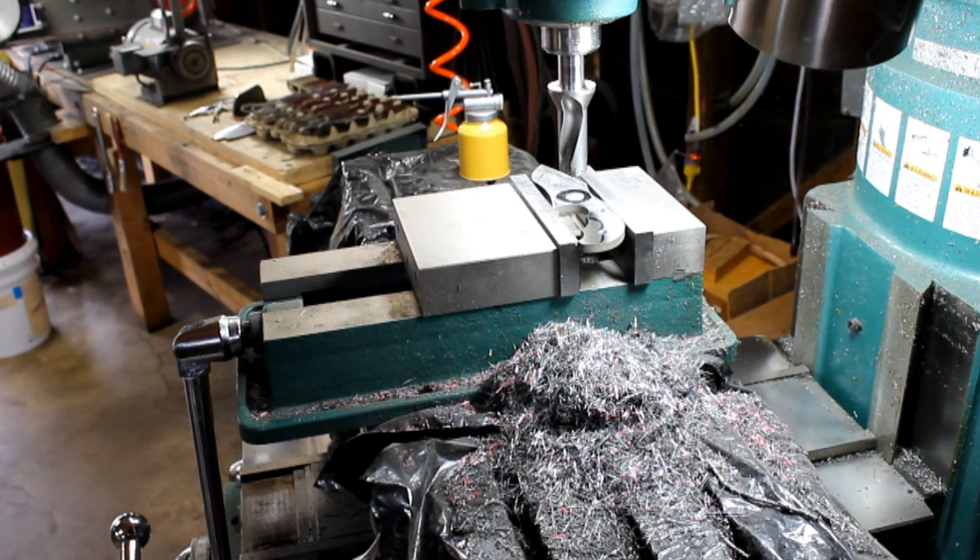Trying to put a tool like this in a drill press is going to ruin your drill press, your piece is going to come flying out, it's going to cause a lot of damage. So if you have a manual mill, then I suggest you use this trick. Back when I was a machinist, this is the kind of tool that we use to bore out ID holes.